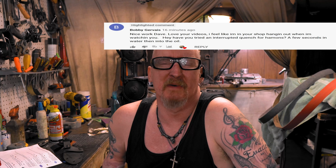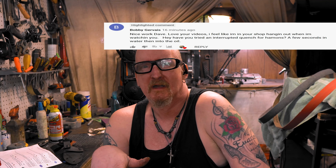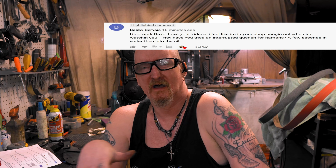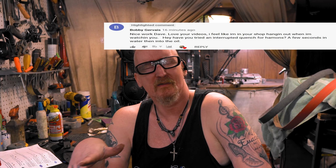So Bobby asked about interrupted quenches. I think I've done a couple videos where I did an interrupted quench. I've done it with W-2. I think W-2 is the only one I did it with, but I didn't really see that much of a difference. Parks 50 is fast enough with W-2 where it's good.